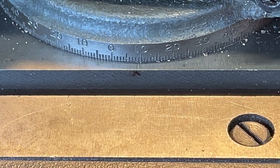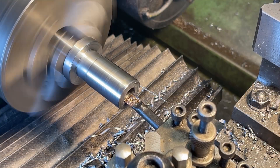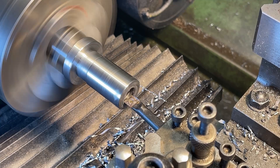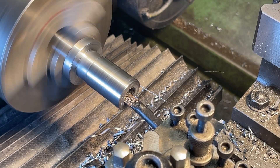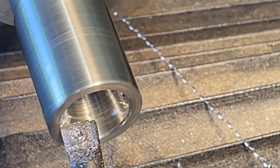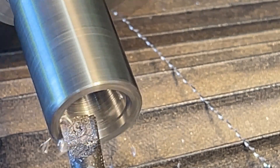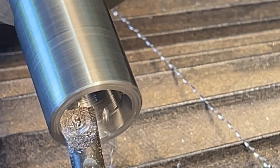The top slide is moved over to 10 degrees — this is a taper that I find works quite well in these situations. A boring bar is then used to open out the taper using the top slide only for the longitudinal cuts and indexing the cross slide out. A really good finish can be attained if you take a bit of time.